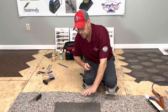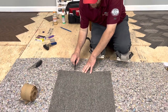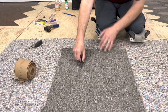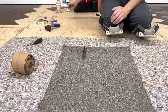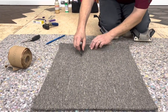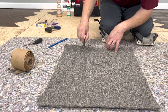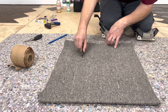We're going to get to it right here without any more talking. I'm going to take this little comb row finder and I'm just going to start feeling my way around here in the runs, in the rows of carpet. There we go — I have already found a run. You don't just take it and push straight through. You go back and forth. It will find a row on its own as long as you're not way crooked. If you just set it down anywhere and start working it back and forth, it will fall directly in the row.